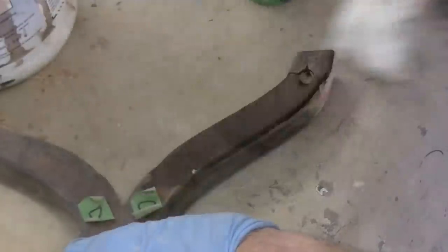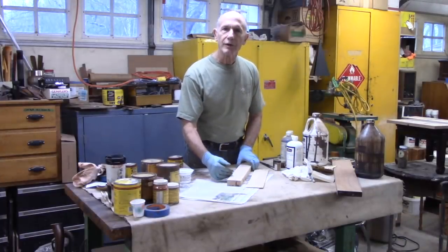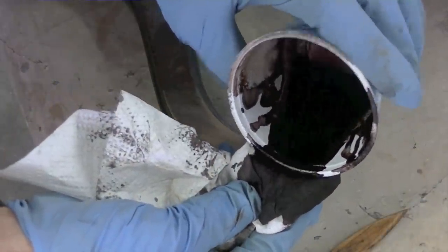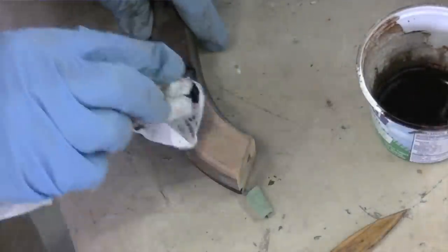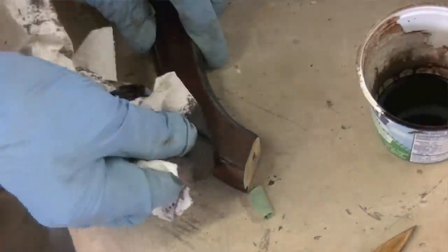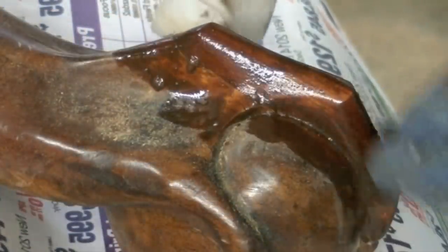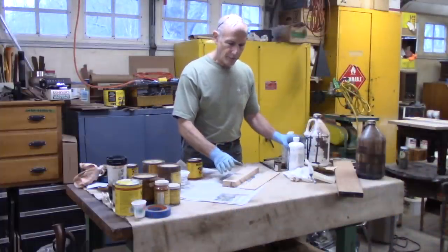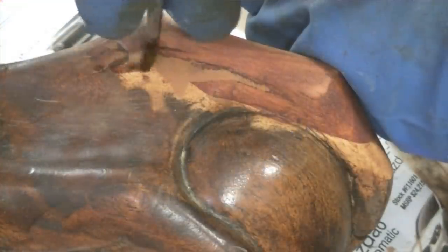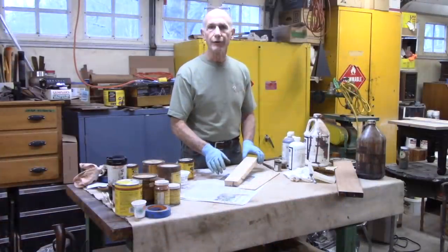In a dye stain, the solvent ionizes the color. So when it's applied to the wood, at a molecular level, it electrically bonds with the wood fibers. That's one reason it can be very tough — if not impossible sometimes — to remove that stain from the wood if you make a mistake. With a pigmented stain, the pigment is lying on the surface, which implies a certain amount of opacity. With a dye stain, you've penetrated the wood — all you see back is the wood grain itself and the chatoyance, which is very important if you're using figured woods.